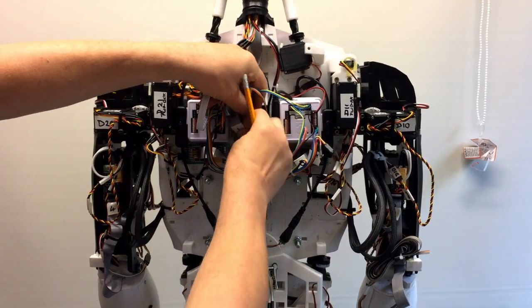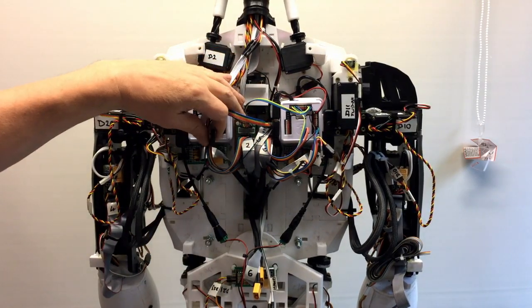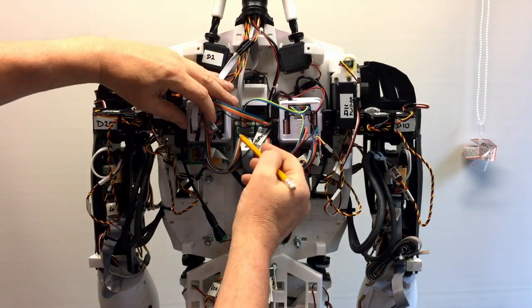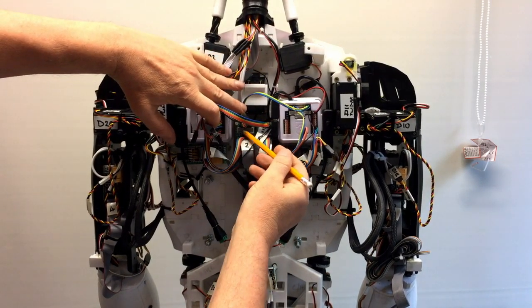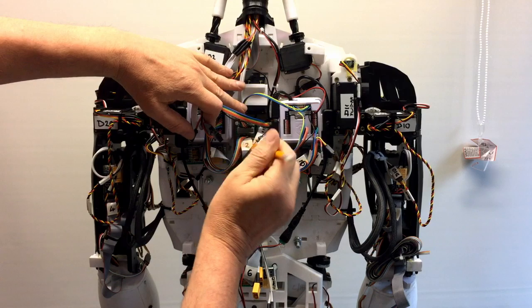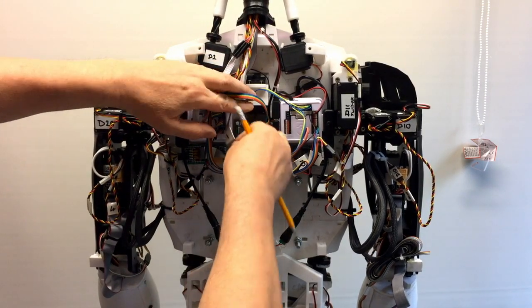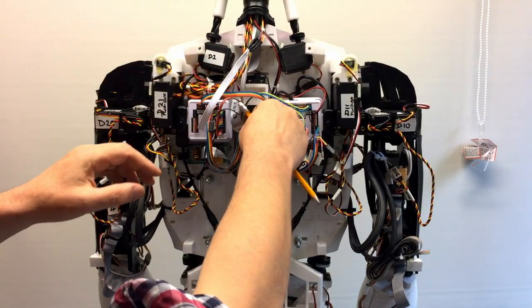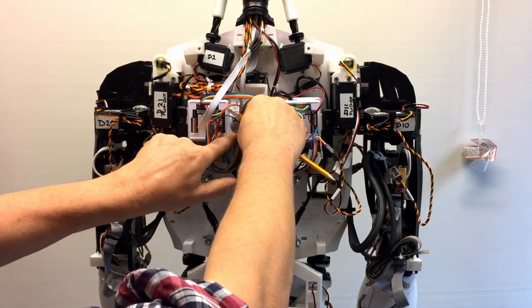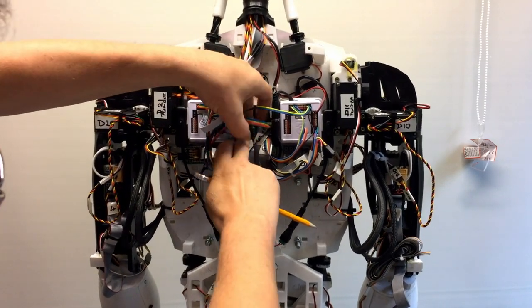So, for example, that is eyes or head. You can see in there. Just make sure you can see that. Yeah, you can. So these are the incoming signal wires, and then they're broken out to a ribbon cable connector, which is exactly the same pin out as Gail's original system. As I say, I've had all the original cabling, so I'm reusing as much as possible and just reconfiguring it. That ribbon cable will just plug into the back there.